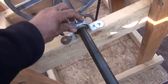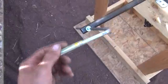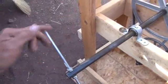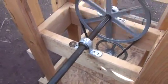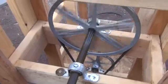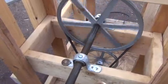Let me go ahead and just walk you around here. These are all just pillow bushings with little grease inserts at the top that you can put oil inside of them. The hand crank itself I've designed loose like this because the inertia when you spin it will actually drop that handle back this way instead of grabbing your arm. If you're going to build something this big, I just suggest putting a freewheeling design in there. You can see if I stop that and watch that lower pulley — I can get that thing just cruising. Very fast RPMs just out of a simple hand crank turn.